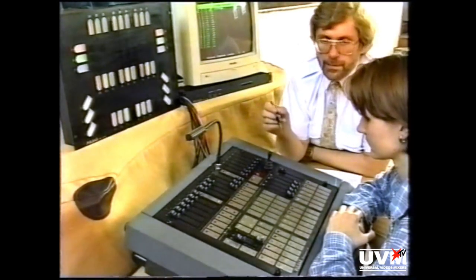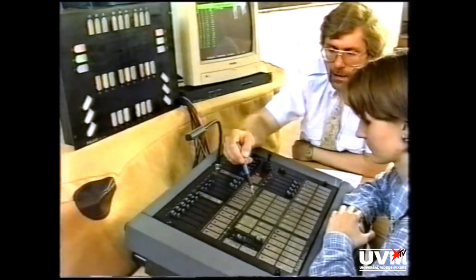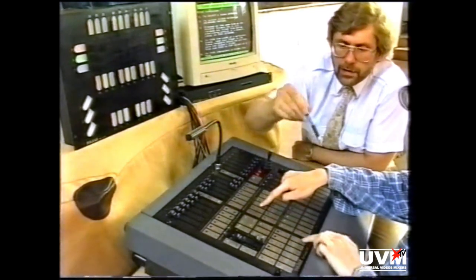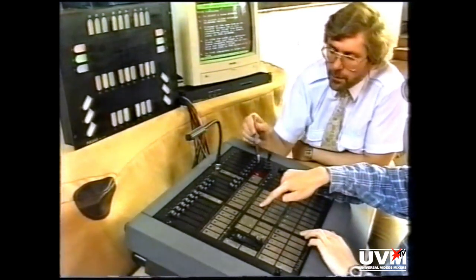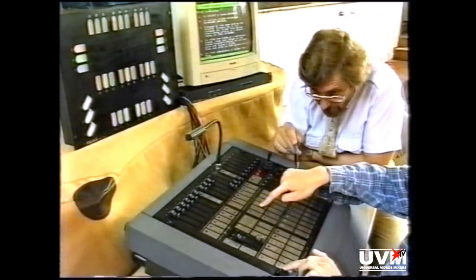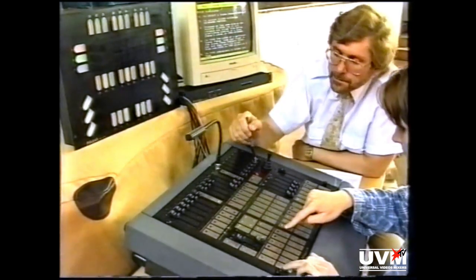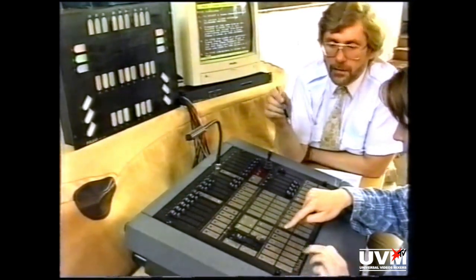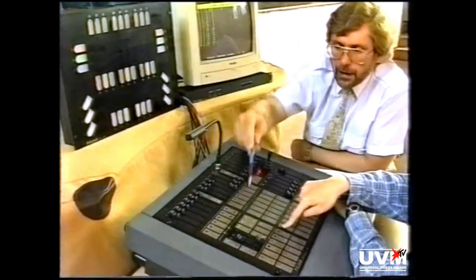Is it possible to see what fade times have been stored with the scenes and chases? Yes — whichever key you use, every time you press it, it'll give you information about that key on the LED display. For example, scene seven here has a fade-in time of one, and a fade-out time of five. Similarly, if we take the chase key, it'll give me more information about that chase. So here, for example, we have a fade-in time of five, and a fade-out time of five as well, with a speed of 90 and a slope of 100. This might actually be a useful time to talk about the enhancements for the view system. If you keep your finger on one of these keys, then you can touch the keyboard without having any effect — you're not actually switching anything on or switching anything off. But if you just touch one of those keys and watch the display, you get all this information and you can interrogate anything. Perhaps you'd like to interrogate chase keyboard number one — it shows the in time, zero, out time, zero. So you can get all the information about any of the chases as well. Notice the lights here.